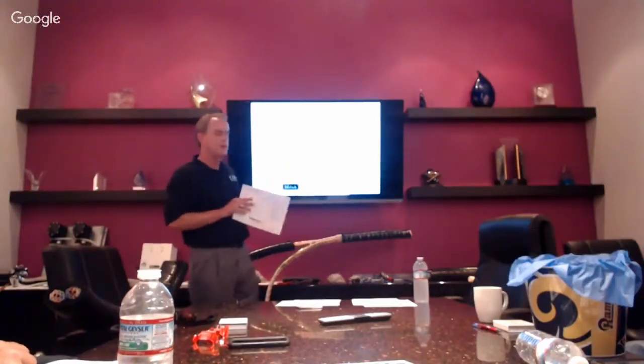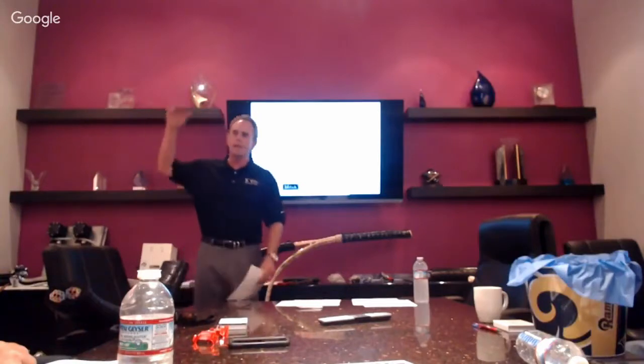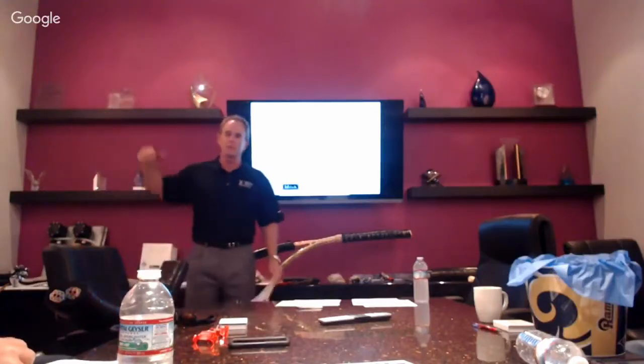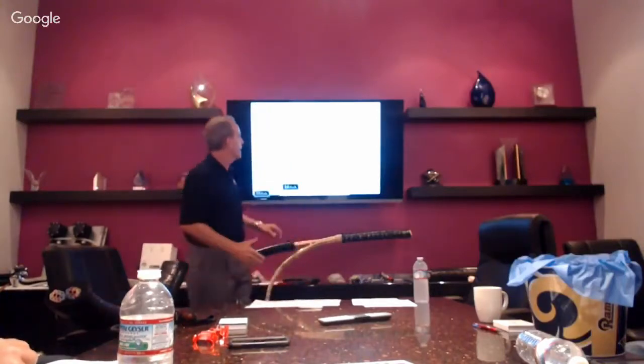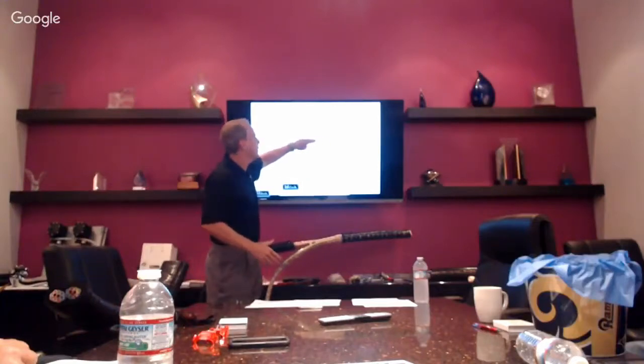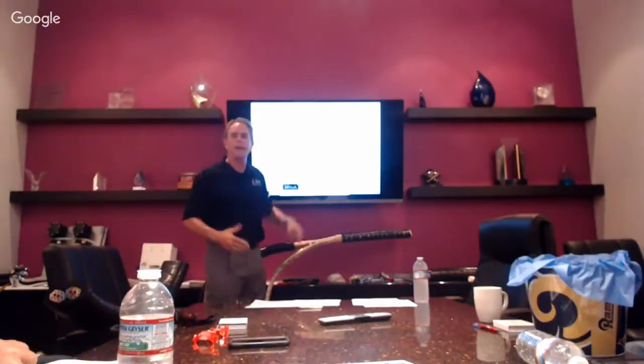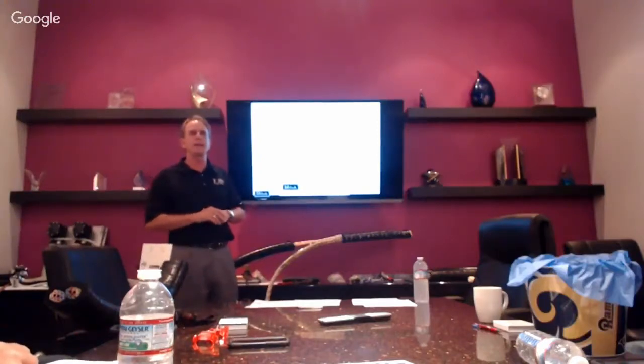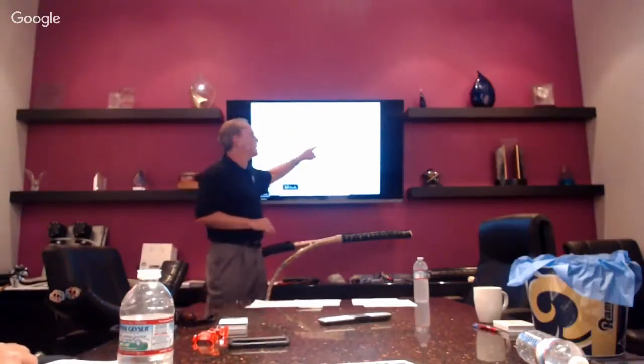Now we have been asked, I don't have room for that radius. You may have already seen them on site, but that 24-inch radius, that's a big ass thing. That's another technical term. It's very large. And sometimes they can't go deep enough to bury it. Well, you can cut it off here. You don't have to use the whole radius. You just got to stub it up, cut it at an angle, and you can use part of the radius. That's been popping up pretty regularly. I can't get them deep enough. Well, bury it as far as you can and just keep the radius and cut them. Cut it halfway through the turn. It's not that we need that whole piece, it's just we need that radius.